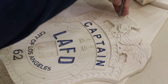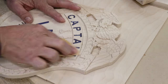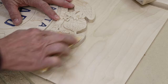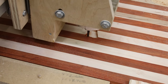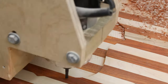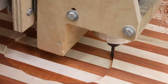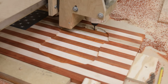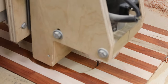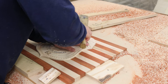A nice short chisel helps with the cleanup and the fine detail. And of course, we have to sand. When I cut the pocket, I started with a quarter inch end mill, then came back with an eighth inch end mill set right to zero, then came back again with a three one hundredths offset just to give a little more space so that the badge would fit inside. And it fit tight and perfect — a little love tap and it was good to go.